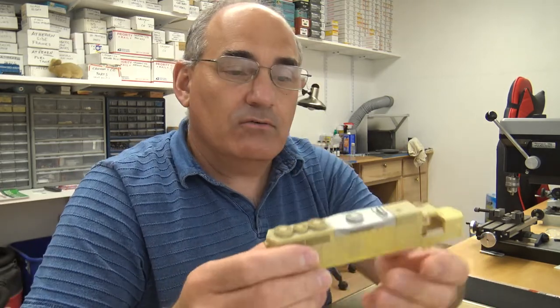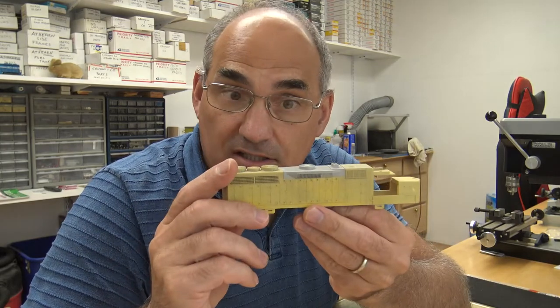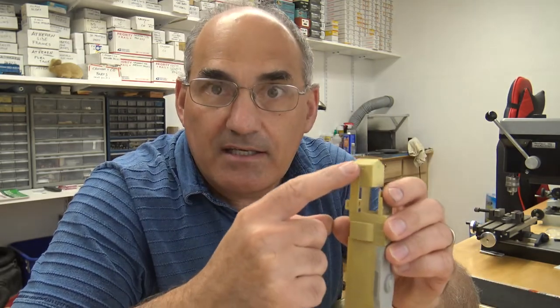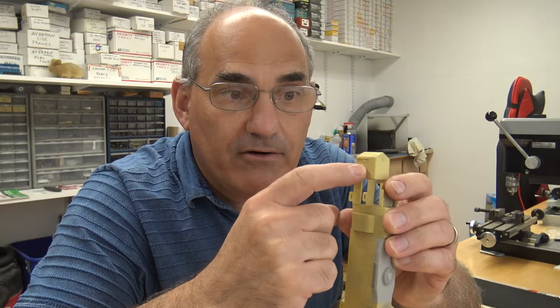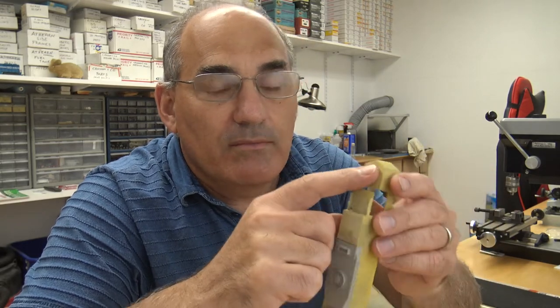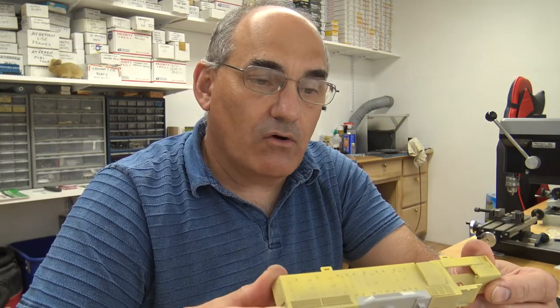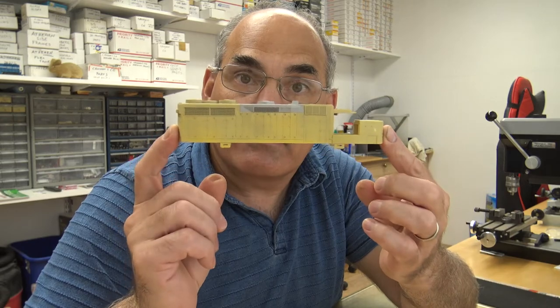So, what I need to do is deconstruct this hood. That would be removing the inertial filter hatch, removing the exhaust hatch, removing the dynamic brake fans, and all of the radiator fans. I need to cut out the brake pump area, or the minor brake area. I need to remove the sanding hatches front and back, and I need to fill all of the grab iron holes. And I believe that is it. So, without going on anymore and trying to think of things to say, let's get right to it and start deconstructing